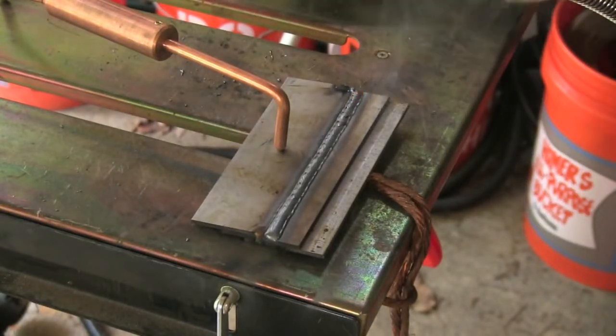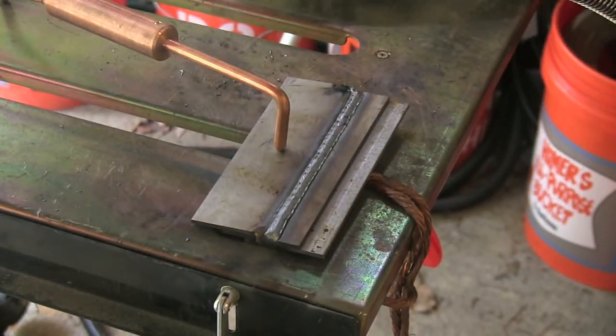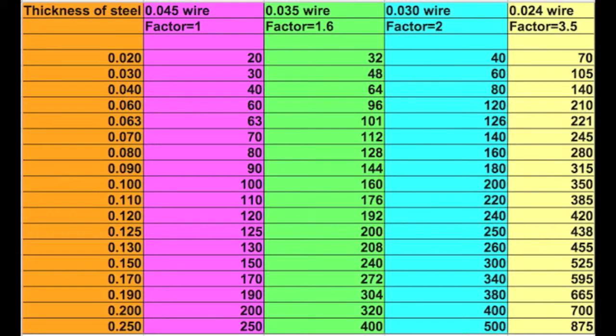This is just one way of setting voltage and wire feed speed. It works for me without a chart, it's repeatable, and it's more accurate than just grabbing a piece of scrap and eyeballing it — but it's definitely not the only way. If you've got a better way, I'd love for you to share it; leave a comment and tell us how you do it. Say you're welding on a Sunday afternoon, you've got to get a part delivered by Monday morning, you've run out of .030 wire but you've got a spool of .024 handy — what do you do?